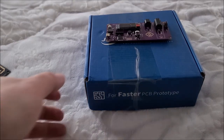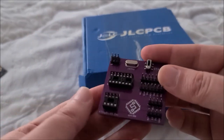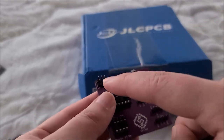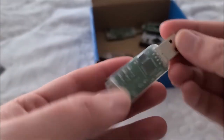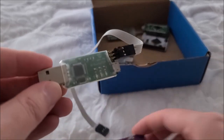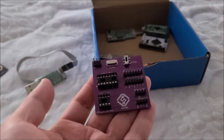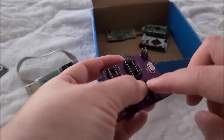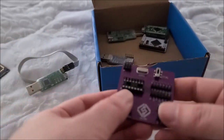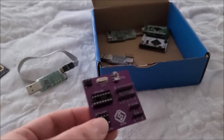I've been moving on to the ATtiny series of processors and recently designed a development/programmer board for them. It accepts ICSP — a programmer like my Arduino ISP plugs right in via USB. You can select internal oscillator or external crystal via a switch, plug your chip in, and it breaks out every pin so you can connect to a breadboard, LEDs, or whatever you're developing for.